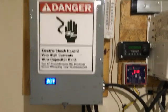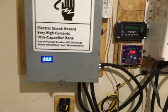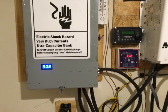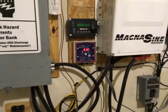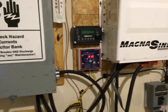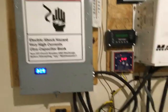To give you an idea: I ran this particular setup off-grid starting last night around 9:30. I got up this morning and checked the system around 8 a.m., and it had run all night long. At that point the system was already beginning to recharge the batteries because it was in AC-coupled mode and the sun was out. The battery bank was at about 20% state of charge and had about 16 amps coming in.